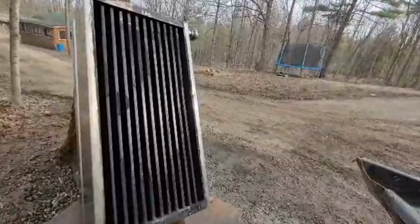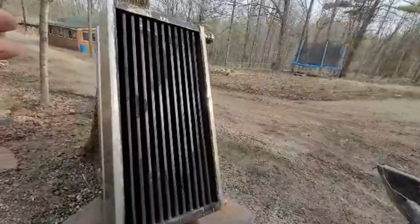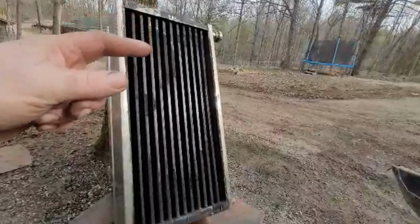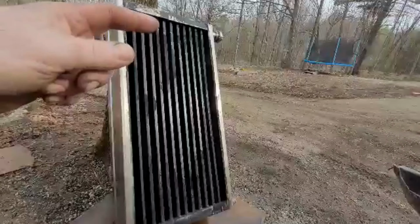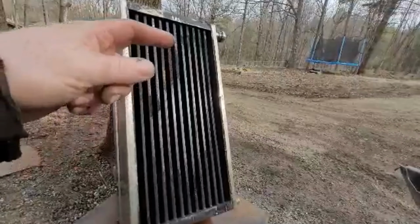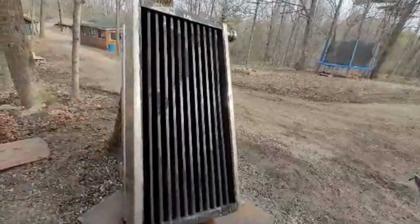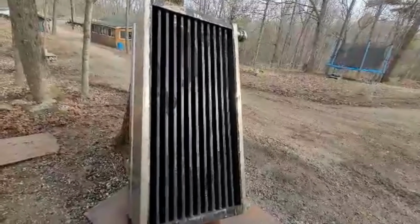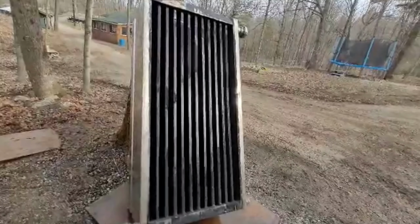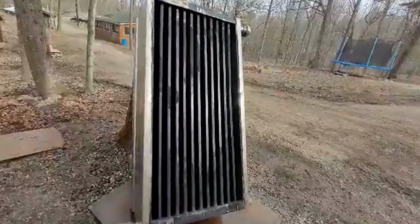You can see those flues there, where I was talking about the flues, where you see it boiling. The reason why it's boiling so hard is the fire actually has to come through up underneath the evaporator, the arch, which I'll show you in a second here. But the heat actually goes through or beside each one of those flues. That's how you get that hard, fast boil. When I start the fire, I can have a boil going within about 40 minutes. If I keep on the fire, I'll have a good boil in about an hour or less.